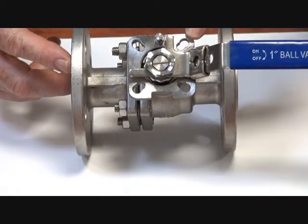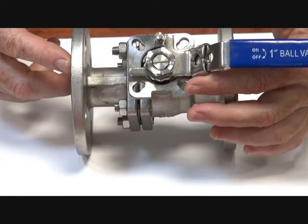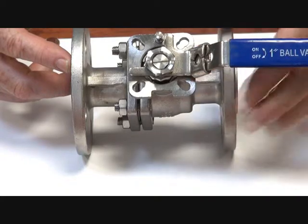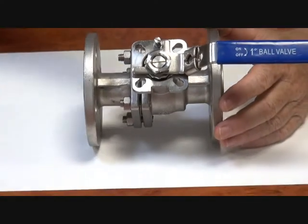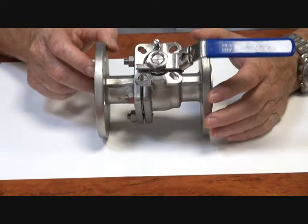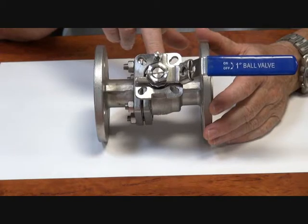You can move the handle to convert it to a pad mount. The handle has a little locking ring which you can padlock — the locked position is on the north position. The open position is with the handle in the direction of flow, or closed through 90 degrees with the handle at right angles to the flow.